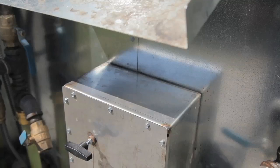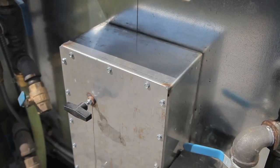Earlier designs of my boiler had the combustion air admitted near the bottom of the firebox, but more recent models have that air piped in near the top and the back for cleaner combustion. Air is admitted through 22 5/8-inch diameter holes, so it reaches all of the combustion over the whole area of the firebox. This air is supplied by an air box assembly at the back of the unit.